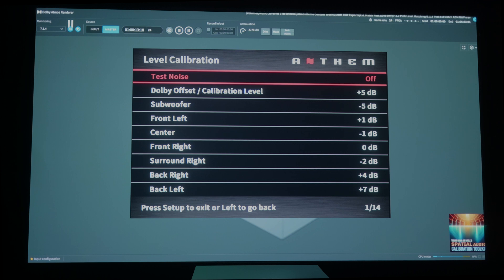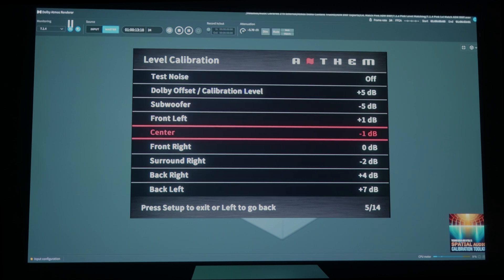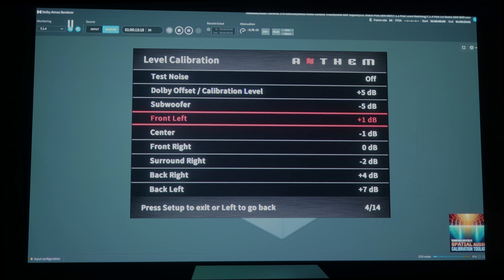I need to go to the front left speaker. The first thing you want to do is turn your audio all the way to reference — I'd suggest putting on headphones or earmuffs so you don't damage your hearing. Now that we're at reference, we're going to calibrate our speaker levels at reference. We're going to use our SPL meter, and once we get our levels to 75 dB, our speaker is going to be calibrated to reference. Normally you would do this in your main listening position.